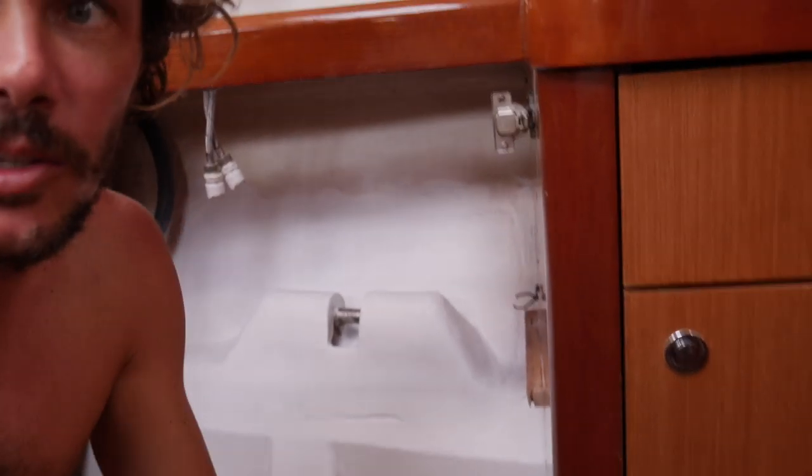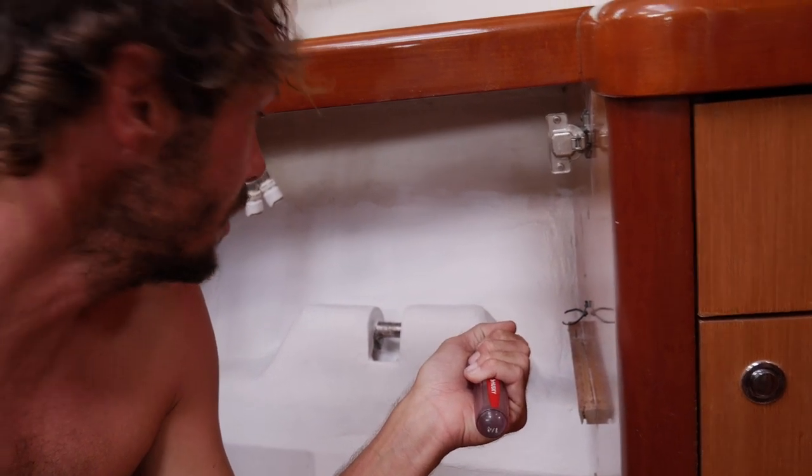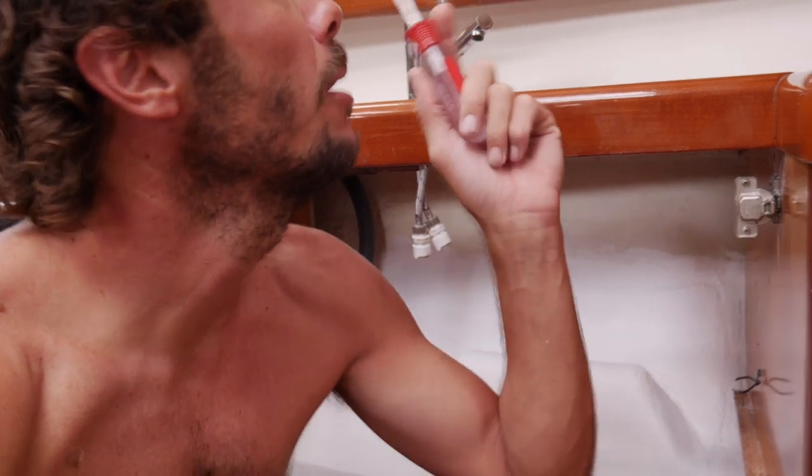Alright guys, so as you can see behind me here, they've finished the new chain plate. They fiberglassed it, gel coated it, it's all locked in now. So what I'm going to do next is remove the chain plate cap from the top side, and re-bed the chain plate cap with some sealant and so forth, and then I'll just sort of loosely put that down, and then tomorrow I'll cinch it down, and then I'll install the tie rod tomorrow,